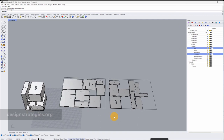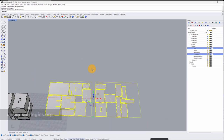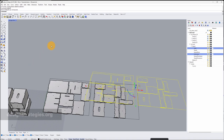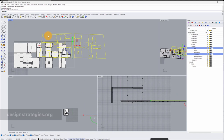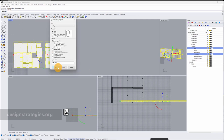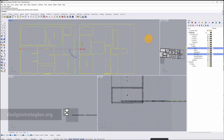The last step is preparing for ShaperTools. The Shaper tool needs 2D curves — these are 3D objects, so I select everything and use the command Make2D. I made the mistake of doing this in the perspective viewport, which distorts the output. So I select my nesting again and run Make2D in the top viewport instead, which already looks much better. The last thing to do is export it as an SVG for the Shaper tool.